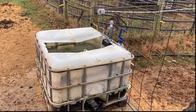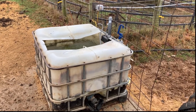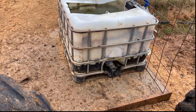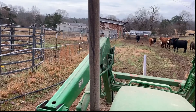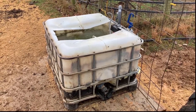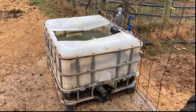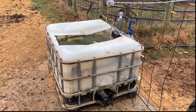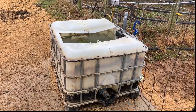The problem was the water line freezing during winter months, so this year I had a company come out, trench it, bury the water line, and put me another hydrant out here. I also took the time to pour a concrete pad to set it on — it was sitting on just dirt before, close to the chicken house, and the cows and horses would tromp down the dirt leaving it sitting on a mound. You can see I cut off the top half section of the railing cage on the tote, and then cut a rectangle out of the top of the tote itself for the cows to water from.